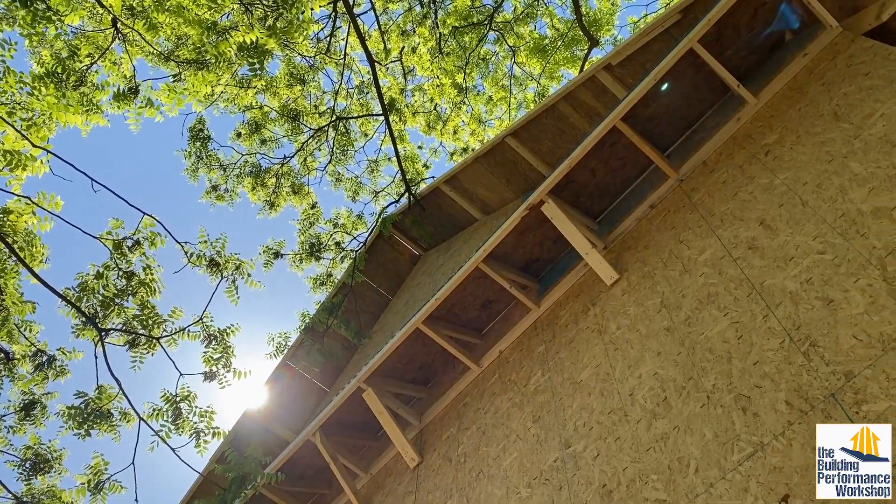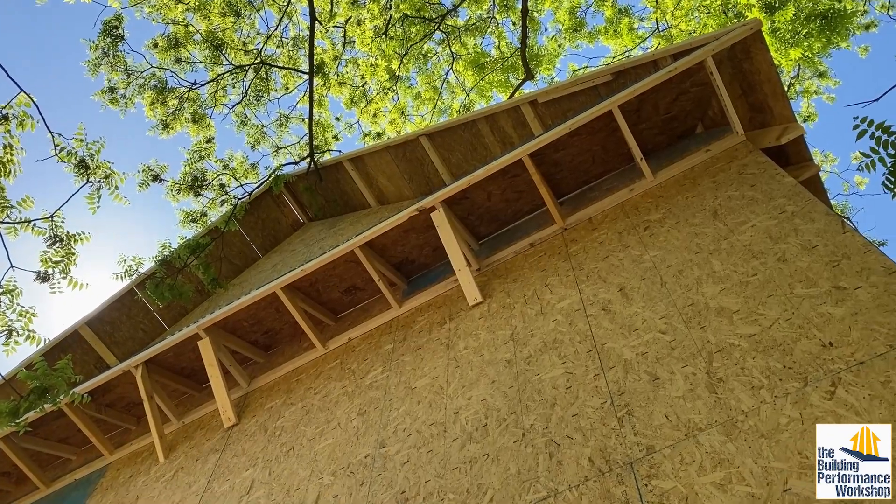What are we using to seal this up? We're looking at a liquid-applied membrane — we're using Thermacoat — but before we do that we're going to address all the seams first. We're going to caulk all the seams and basically spray on top of that. It's a liquid-applied membrane, but this is better than others on the market: low VOCs, it also helps with radiant energy. It's typically applied on the outside of a structure, but we're going to apply it to the sheathing and also to the crawl space, and show some details of how to properly seal a crawl space, meet the energy code, and keep the termite guys happy.